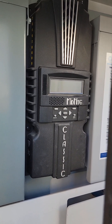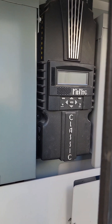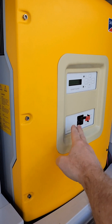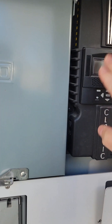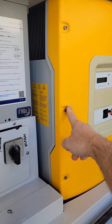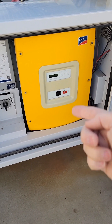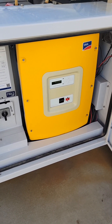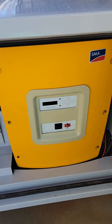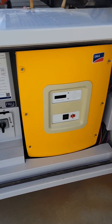This right here is the Midnight charge controller. Its primary responsibility is to charge the batteries. An important thing people often forget: if you leave your trailer running and your Sunny Island shuts off due to a very low battery going into emergency shutdown mode, the Midnight charge controller will continue to charge the batteries independently. So you might come back after a week or two and turn everything on, but the Sunny Island still thinks the batteries are at ten percent and will immediately shut down — which can be really frustrating.